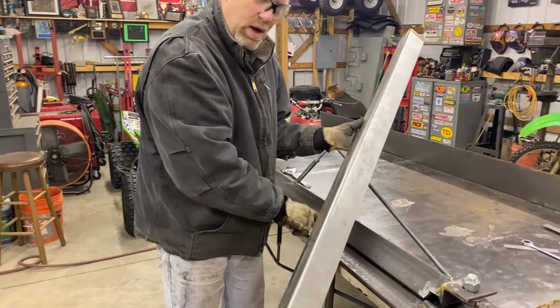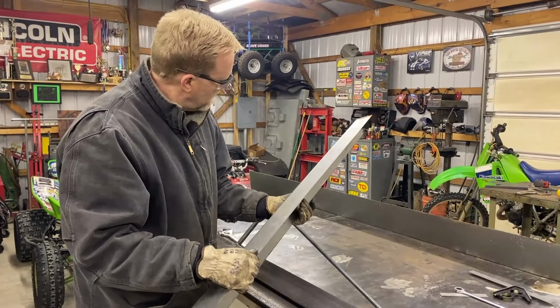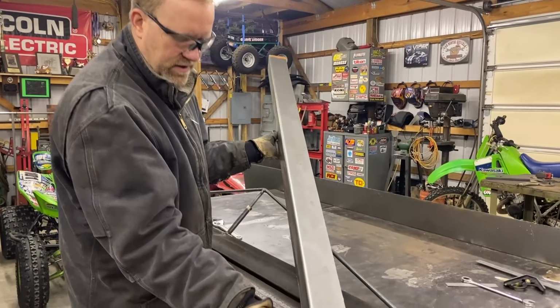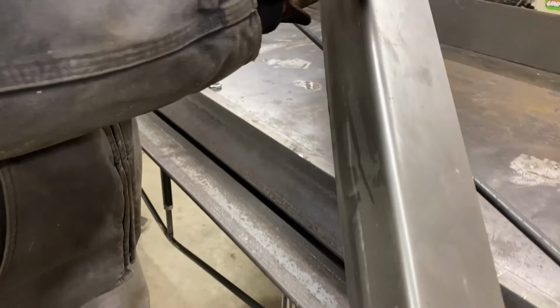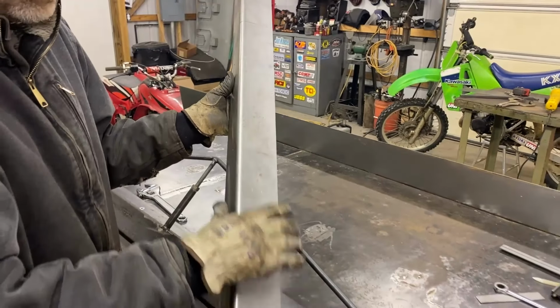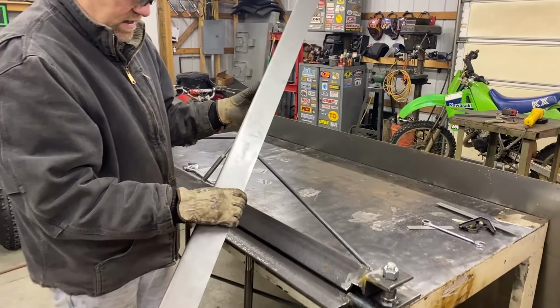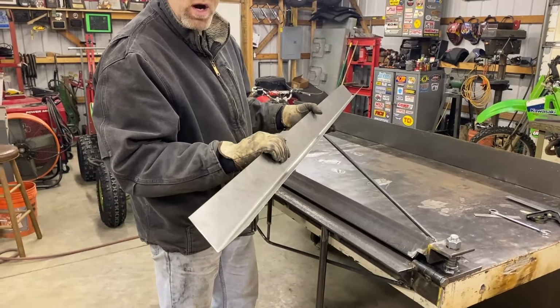So it's still bowing in the center. So you can see it's tight here. You can see this radius, and you can see that it gets fatter here, so that means that it's bowing in the center. So either I tighten up my truss a little bit more, or maybe put some more stiffener in it. So it works.